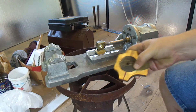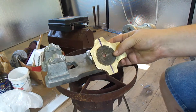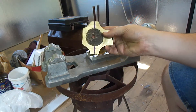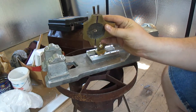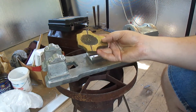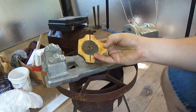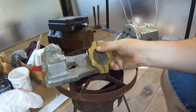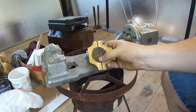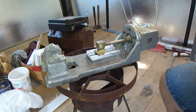I also took and did layout and stuff on this. I'll cut it in half, solder it back together, stick it in the lathe, and then use a turning tool to remove all this — so that I'm not wasting all of it in shavings.